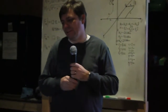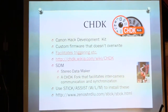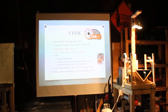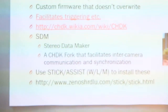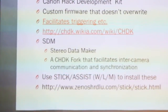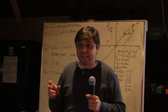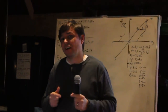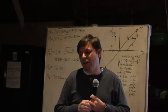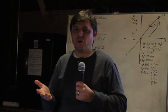Question: did you fabricate the USB trigger or buy it? I fabricated it — I'll show you how, it's really easy. There's good documentation on CHDK and an active Yahoo group that answers questions quickly. SDM — Stereo Data Maker — is a fork of CHDK set up to work with multiple cameras synchronously, syncing zooms and other functions. I tried that first and struggled a bit, so I ended up just using standard CHDK, which works fine.